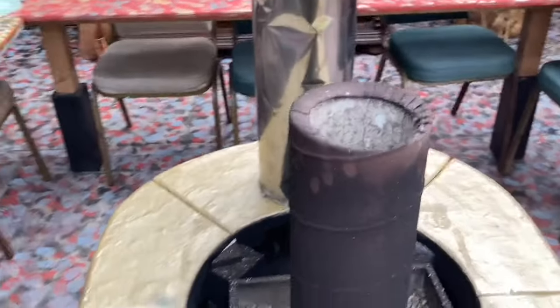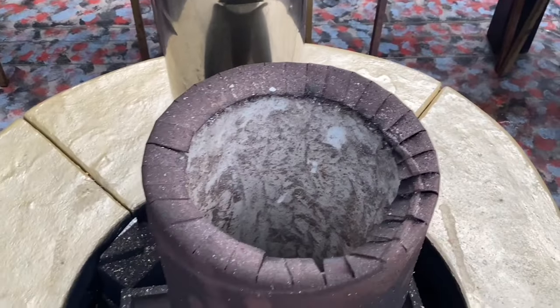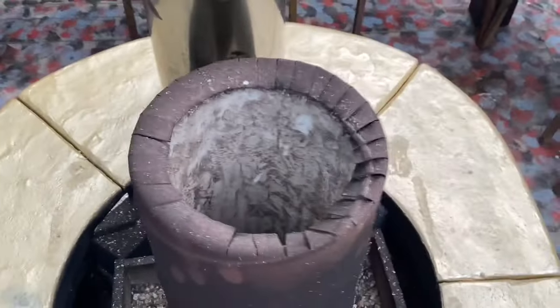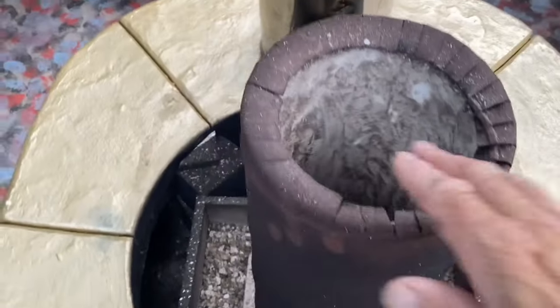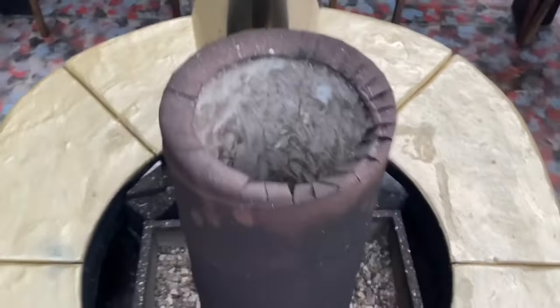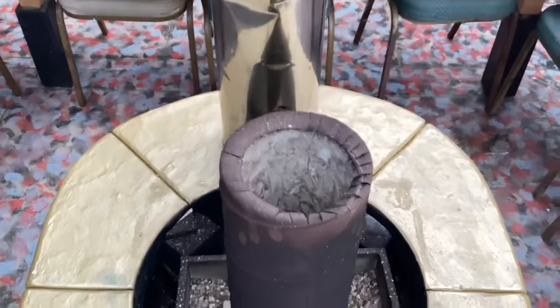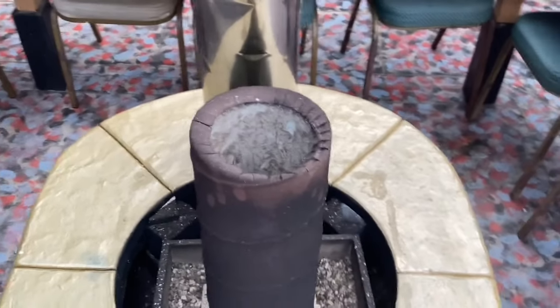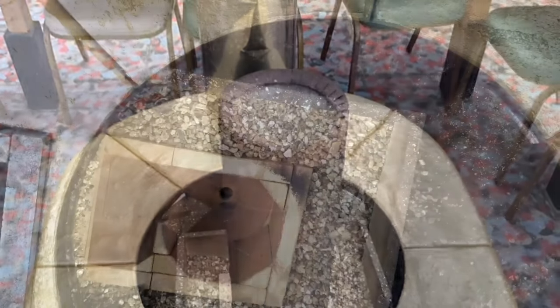It's quite a short riser but it seems to work okay. Incidentally, this riser has been lined with ceramic fiber - it's been going for years and has a tough resilient finish. I covered it in water glass, and I don't see much danger of fibers coming off because it is quite thick, but nevertheless it's not something one would really want to recommend to other people because of the danger factor from the ceramic fiber.